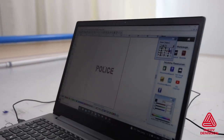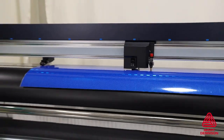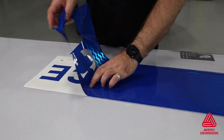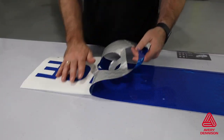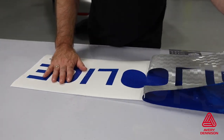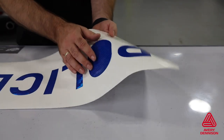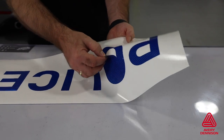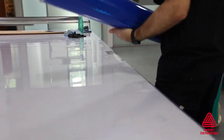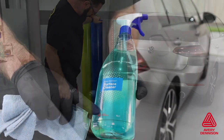This means it's time to start the plotting process. Load the file in and begin the cutting process. Once the program has finished, it's time for weeding. Slowly remove the excess film and hold it away from the surface so the high initial tack of the adhesive doesn't lift off a letter or number. For in-between letters and numbers, use a weeding tool or simply fold the liner slightly to remove the excess film. Always store the roll vertically and not flat on a table — this will ensure there are no adhesive impressions on the film.